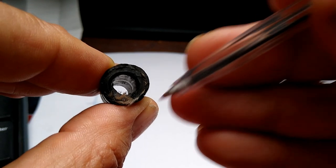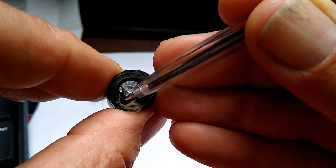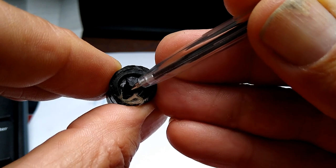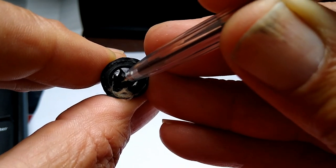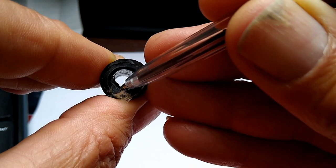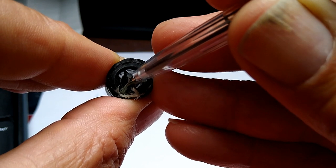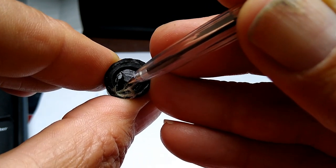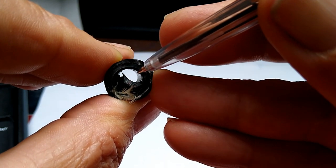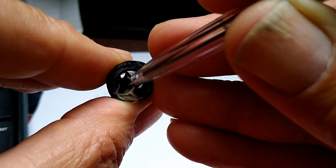Now look at this. My turning of the hose fitting has cut a sort of flap away from the wall. This was okay till I removed the fitting to check the hose, and then refitted it. The flap of rubber was now dislodged enough to form a partial restriction of fuel flow. Not enough to stop the engine unless the vacuum pump needed to work quite hard, like under G-loads, to get fuel through. The extra pull of the booster pump overcame the problem.